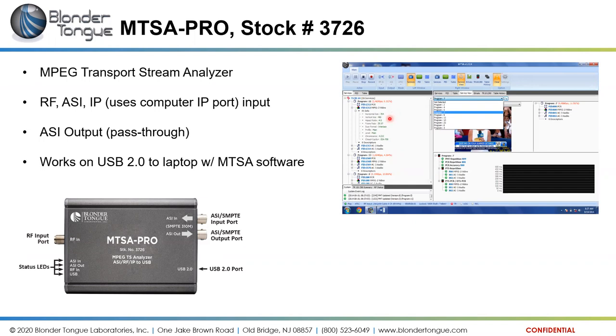You can see it breaks down the video, telling us it's a 480 standard definition signal, 4:3 aspect ratio, and so on. If I expanded these audios, it would open up the audio and show us all of the specs about the audio as well. It does show a picture of the program that you're evaluating, as well as several of what are called TR101-290. Technical Report 101-290 is a standard for MPEG signals, and the quality and accuracy of those signals with regards to certain things like program clock reference accuracy and repetition, which are a couple of the things that are measured in TR101-290.